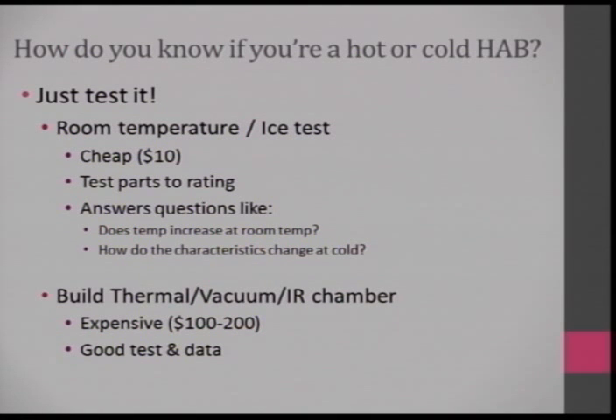The room temperature dry ice test is the most recommended test I'd say you should do for anything you fly: wrap it with cloth, put some dry ice against it, and make sure you have a temperature probe to check if it gets below the operating temperatures and potentially harms your hardware. You could also use a hairdryer and heat it up and observe if things drift around.